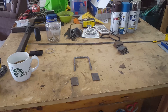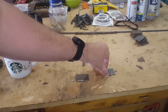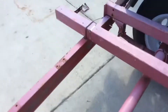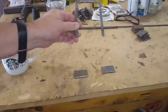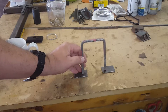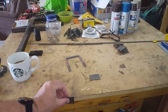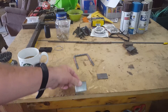I have all these little blanks that I was going to use. This is an old U-bolt off of the utility trailer we made. There's a video of that where he's basically stripping down the boat trailer and took all these off, moved the axle back and stuff. So we have all these. What I'm going to do is cut this down to just about the handle size, weld it to these, drill some holes in it, and then she can mount it to the front of the doghouse lid like that.